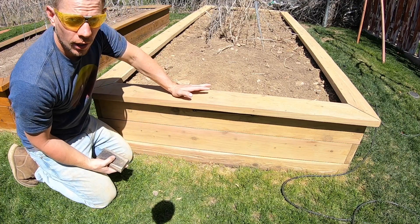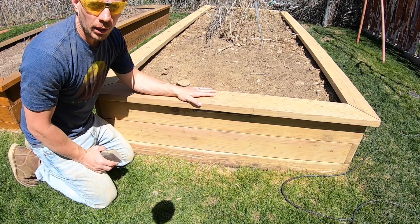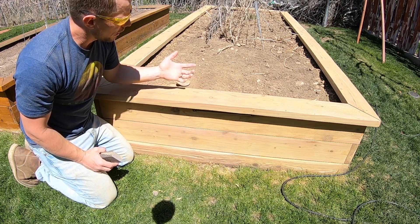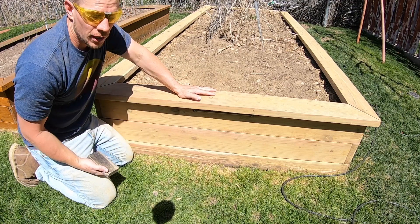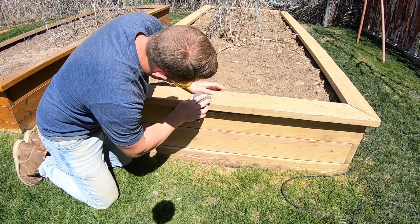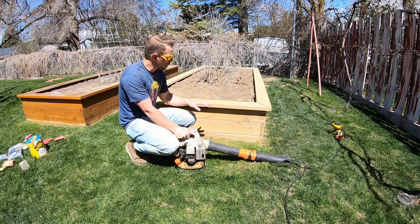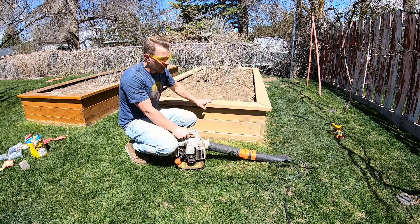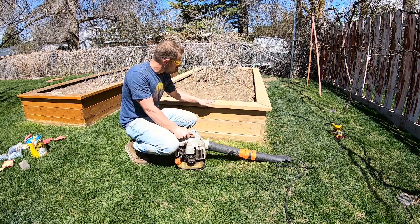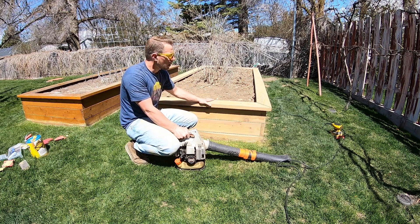This kind of detail isn't necessarily critical for the longevity of the wood, but if you want it to look even and nice, I recommend going the extra mile. It really only adds a little bit more time to your project and makes it look that much better. The look you're going for is definitely in the extra time you put into a project. Everything is sanded but there's dust everywhere, so blowing it down is just as important as part of prepping it. I don't want any of that dust on the wood surface when I go to stain it — it'll just ball up and won't allow the stain to adhere and penetrate. We want to get this as prepped and clean as possible.